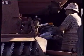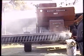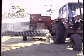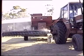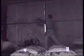Firstly, apply one kilo through the main sections of the header, run the machine for a few minutes, then apply a second kilo to make sure the dust coats all internal surfaces. You can also use inert dust to protect food product warehouses from insect infestations. Clean all ledges and crevices which could harbour insects and grain debris, then give them a good coat of dust for long-term protection.